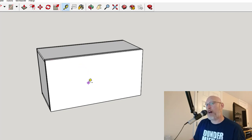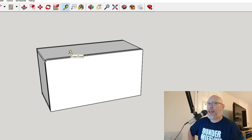I've got a total of 5 pieces that are going to be 21 inches long. So the first thing I'm going to do is make a 21-inch cut. And then I'm going to take that 21-inch cut and rip it down into my 3 11-inch pieces for my back, my baffle, and my second baffle, because I'm going to do a double baffle. And then I can do another cut at 8 3/4 to do the bottoms and the tops. Then keep the saw at 8 3/4 and make a cut for the sides, and finally move the saw to 10 inches for the other side cut. The idea is to cut everything that's going to be 21 inches at the exact same time.